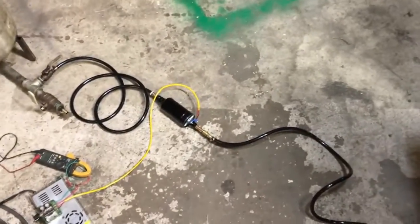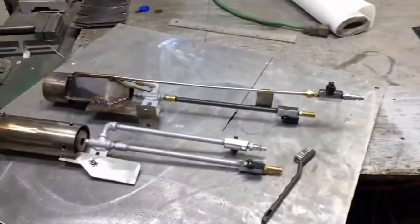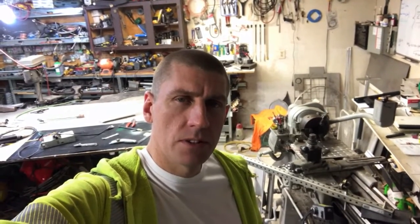I am going to go ahead and deploy this in a better fashion — maybe find some type of enclosure for this thing. We're going to be seeing a lot of testing with these burners with this pump, especially this one right here which has an extra small aperture, making it very difficult with thick, cold oil. It's very late — we won't be able to do any testing tonight, but tomorrow morning, first thing, I'm going to try to get this thing fired up in an elevated position and examine the performance running an oil burner that's higher up than the fuel tank. That's something that's not easy to do. Finding a good oil pump for a decent price can take you a month of research.